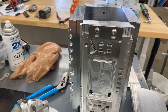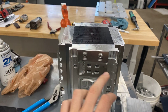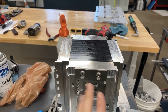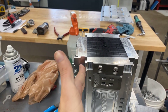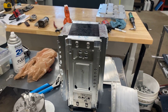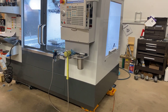There's a top and a bottom. I'm going to focus on the top first, and the work holding is going to be a little tricky. I'm doing it on the fourth axis, and I'm working on this face — there's a five degree angle — so there's another face, that face, and then this face as well. So I'm having to flip this thing all over the place. Luckily I'm not having to work on the other side, but there's a lot to it and it's a fairly long cycle. In fact, I'd say it's a bottleneck in the entire product line.